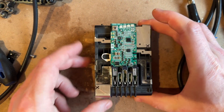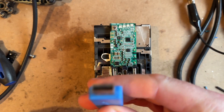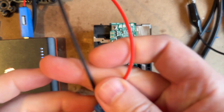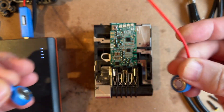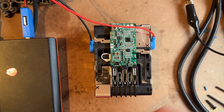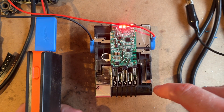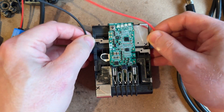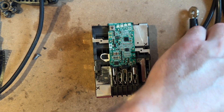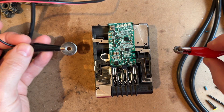For some reason if any batteries are a bit low in voltage, you've got a choice. I've got something like this — it plugs into a USB bank and then on each end you've got magnets. Just make sure you connect it up to the right end, and if it is charging that'll flash. Alternatively, you've got a bench power supply — I've just got some crocodile clips with magnets on the end.